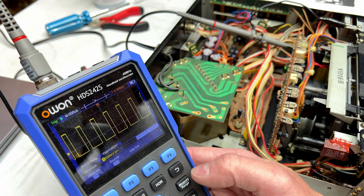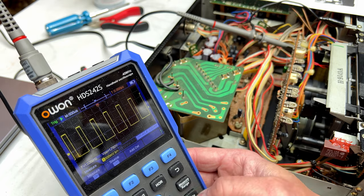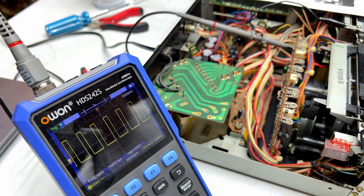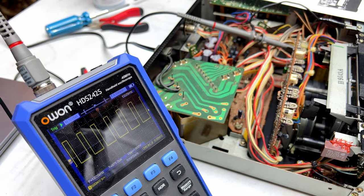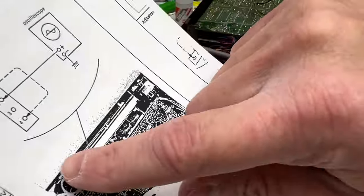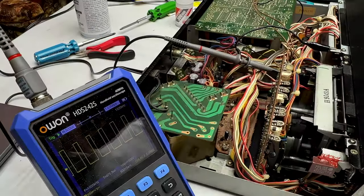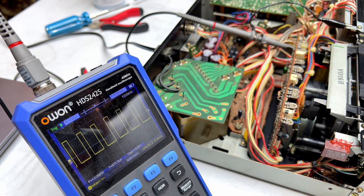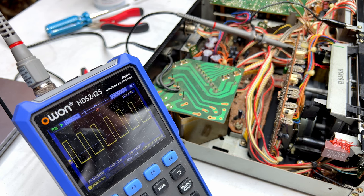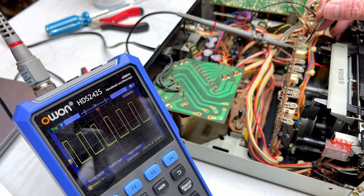And I'm running this with a step-down transformer right now. I pulled the 4-amp fuse out of my solder station to get it back up. Well, folks, if there's a cursor on here, I can't find it. We're just going to have to eyeball this. So they want the waveform to look just like this. And you tell me, does it look like that? It looks like that to me. It looks right about 1:3, but that is where it's supposed to be, 1:3 to 1:4. I could try fiddling with it some more, and I think I will.